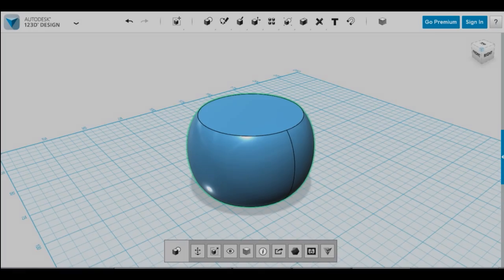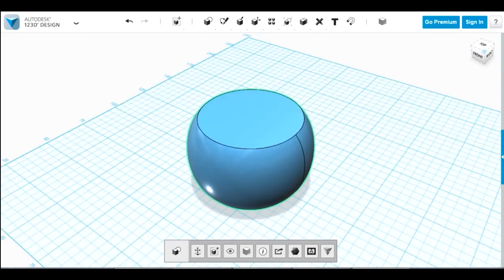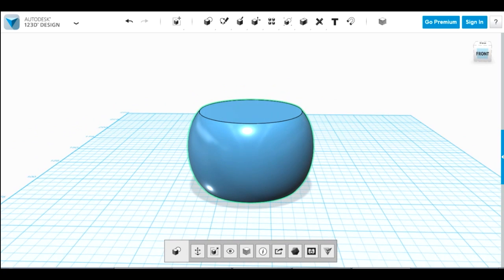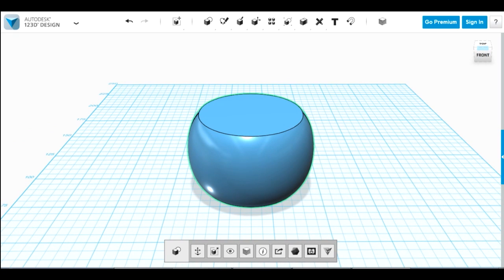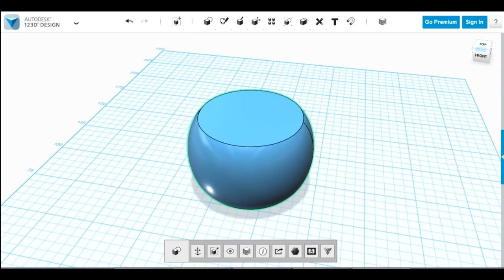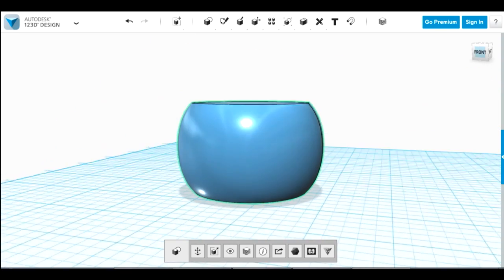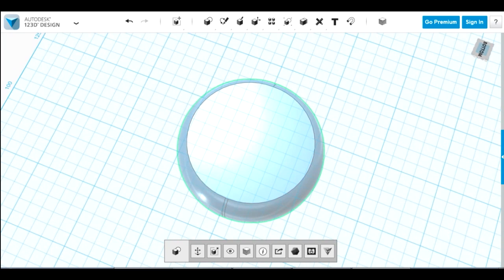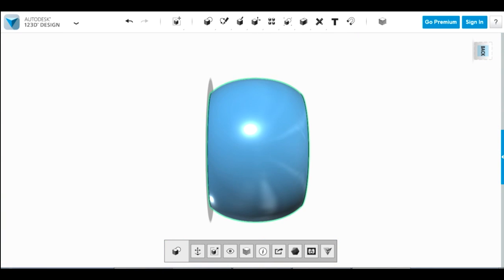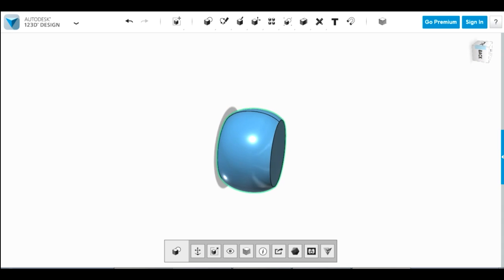So let's have a look at some CAD. It looks fairly uninteresting, but this is the object I'm going to print — it's a kind of little pot thing and it's going to be printed hollow, with no infill and no top surface. Essentially we get something that's shelled out and hollow so we can put a light inside. These things are going to be on their side all lined up, so they look a bit like the hoses on Alien, but they're going to run internally within the head lengthways. So I need quite a few of these.